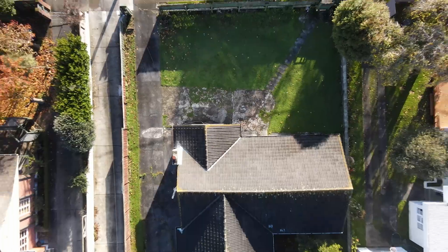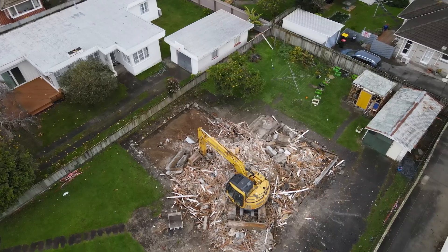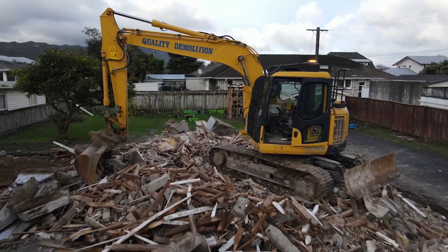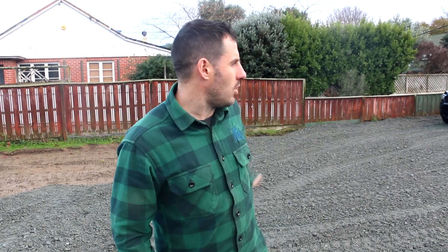It's Thursday morning. We're on the Lower Hutt demo site — well, I don't know if we can call it a demo site anymore. We're on the Lower Hutt two-lot subdivision and we're building the front house. What we're going to do this morning is give this whole site a light compact so that we can spray and mark the driven piles with a pile driver. He doesn't want us to give it a full-on compaction until he's driven his piles through.